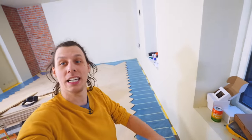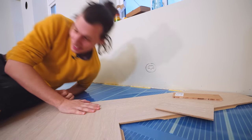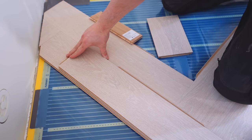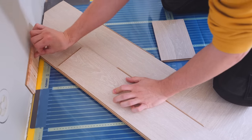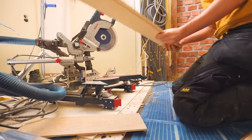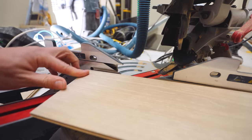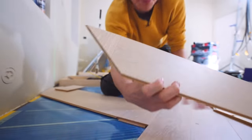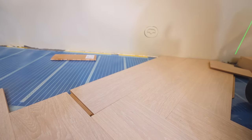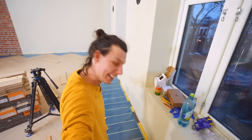First I want to lay the rest of the flooring up against this wall. I've already started practicing — I managed two rows, though it took me way too long to figure out how that works. Here's how: you line the board with the previous one, use a piece of wood with the right thickness as a spacer, then place a piece of the same flooring and that's where you make the cut. Then you take another piece, line it up with the edge, make a mark, and make that cut as well. You're then left with one of these bigger triangles which fits together with the other piece, and that whole thing as one unit should slide in. It's a bit labor intensive, but it works. Now I've just got the rest to do — let's get to it!